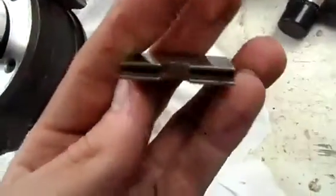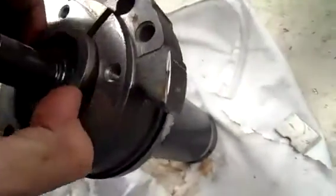A lot of what's in there is not wear — it's just shavings from the angle grinder. But I was able to get the eccentric out. That's what your key looks like — a very hard piece of steel — but that's not worn at all. There's a little bit of rust on it which will probably brush off okay. So I can get this rotor out — there we go. That's also hardened steel. You can see there's a little bit of a stain on it but it's worn down to copper on the edges. Other than that it's all right. There are a few marks on it but that's not too bad. The bearing is a little bit noisy — I'll have to clean that out.